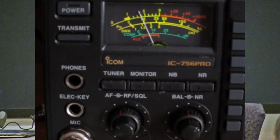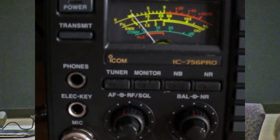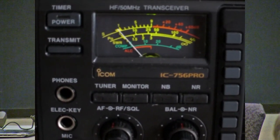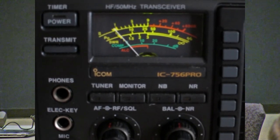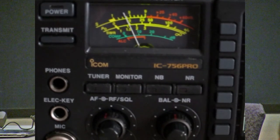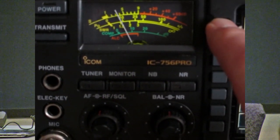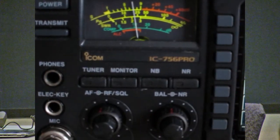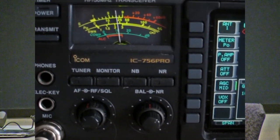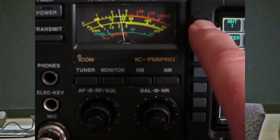Now we'll switch the Beverage to the southwest. Okay, now the Bev Pro is switched to the southwest, and you can't hear the station at all. And now we'll go back to the northeast. And now you can hear the station again. And if we go to the transmit dipole antenna, the signal comes up. The reception in this case is a little bit better because the station is off to the side. But just to demonstrate the front-to-back ratio, going back to the Bev Pro,